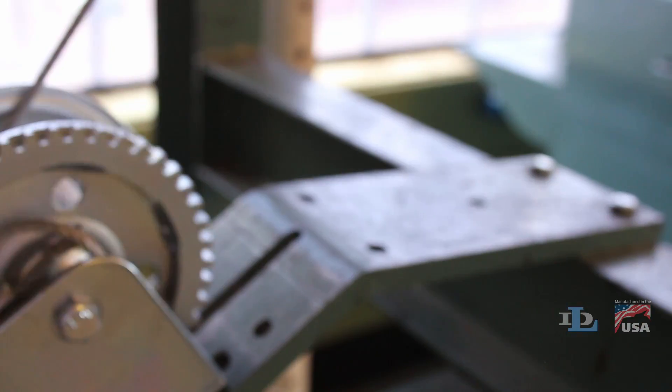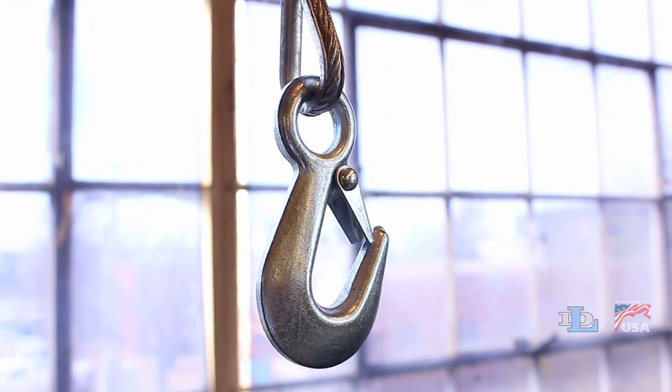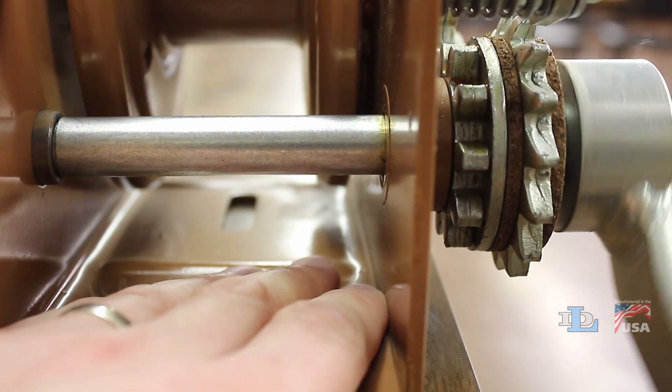The handle does not forcibly turn the winch, but instead allows the winch to turn. This means that if there is little or no load on the winch, line may not come out when the handle is turned counterclockwise and the handle may unthread itself.